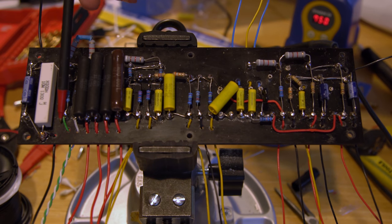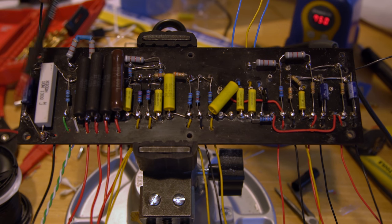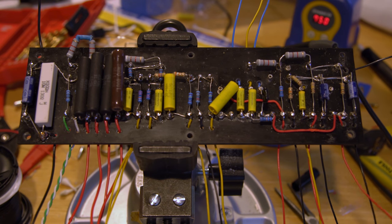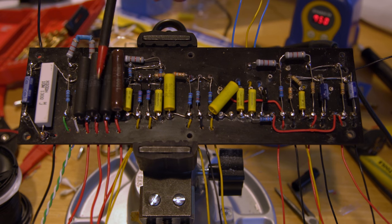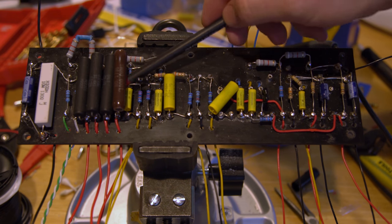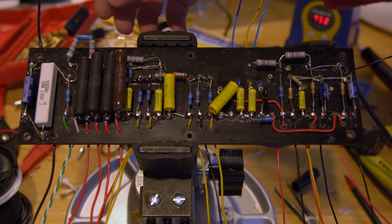I have my four high voltage wires, and I also pre-wound my wire for the 100-ohm to ground for the heaters. I've got some 25-watt replacements coming, and I'll have to set a separate board over here that'll have the second pair because this board just doesn't fit them. I'm going to quickly desolder that one and resolder it correctly — I do not want my high voltage going to ground, that would be bad. Now I'm ready to start prepping the chassis and drop this into the chassis. It's a tight space and I'm trying to keep wires up and a little separated.